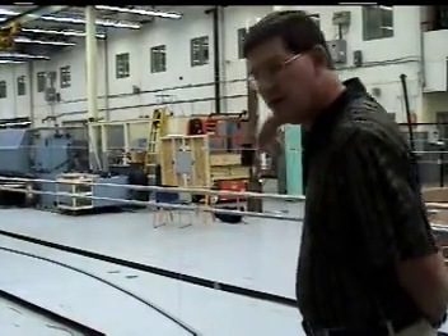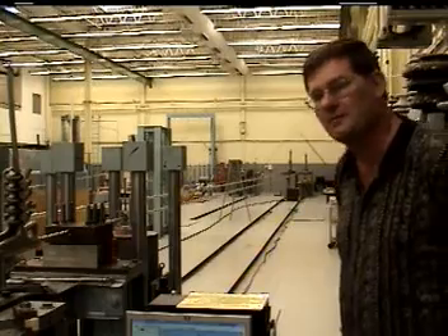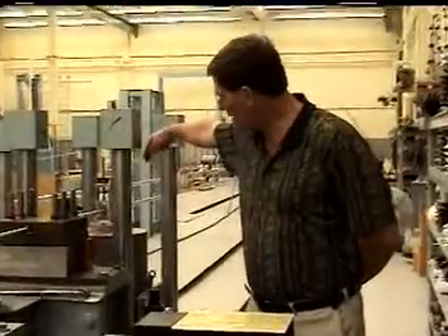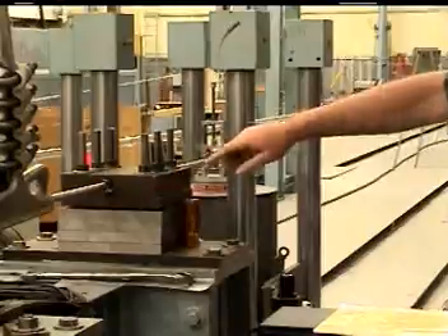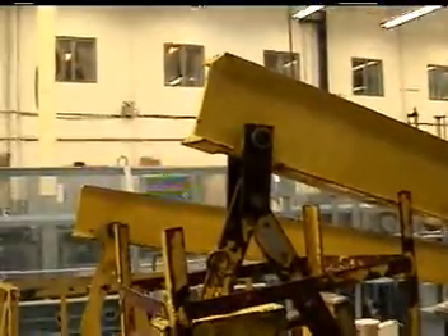We'll now go down to the opposite end of the span and take a look at the instrumentation used to measure the values of the node, the anti-node, and the frequency. We are now looking at the instrumentation end of the span. Here we have the vibration shaker causing the vibration — both frequency and amplitude — exciting the cable. Here we have another rigid clamp attachment to reflect the wave, and also a weight basket and pivotal beam arrangement to maintain constant tension during our testing.